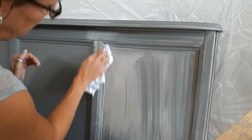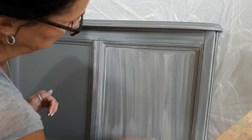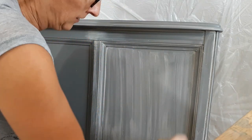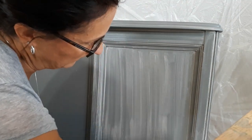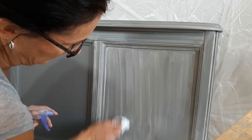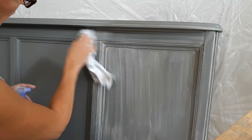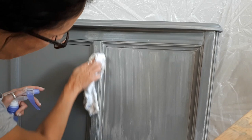You can wipe off as little or as much as you want — just whatever look you want. Going with the wood grain, of course. You don't need to have it perfect. If it starts to dry, you can take a wet sponge to reactivate some of the paint. You kind of want it to be not too perfect. You've got to work quickly before it dries — that's why you have to do it in sections.